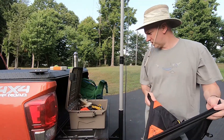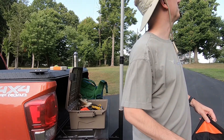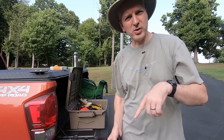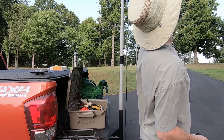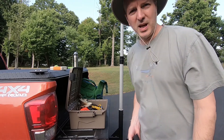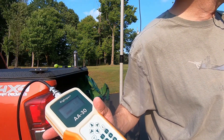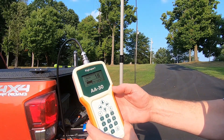I'm going to use my little throw line cube instead of digging everything out of my bag there, because that's a pain in the butt. There's a tree right here. What I think I'm going to do is set my N-FED up in an inverted V as well, just like this antenna, about the same height at this little tree right here behind us. That'll give us a good comparison. So I have the N-FED set up in an inverted V. I have the feed point about two or three feet off the ground, and the end about the same distance off the ground.